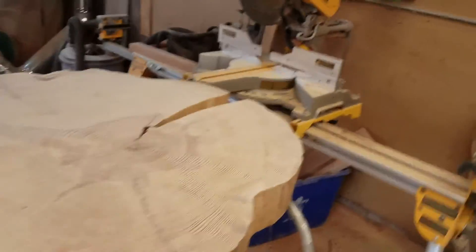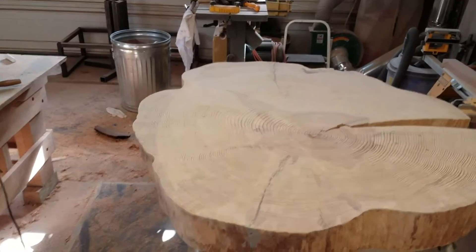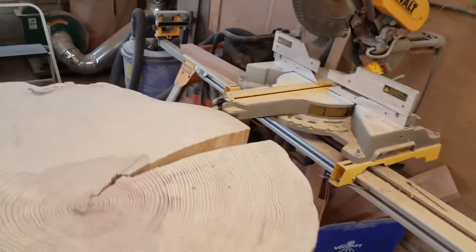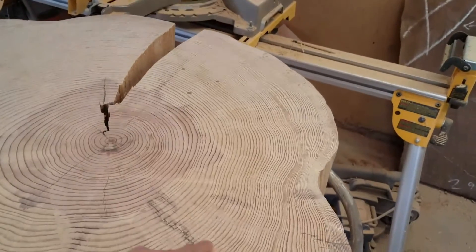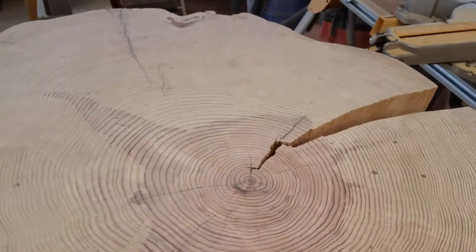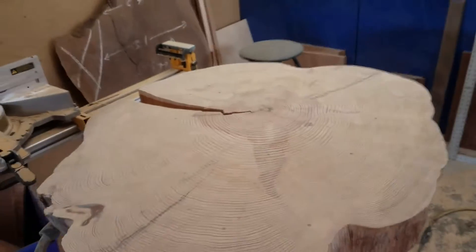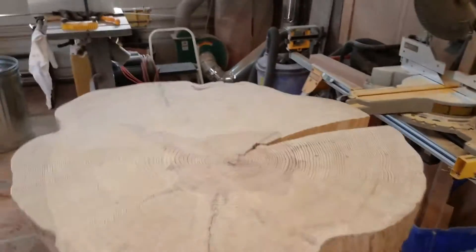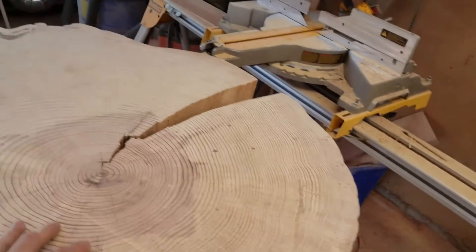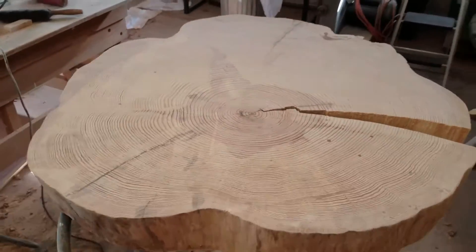Over here we have a major dust producer — whenever you're using the router sled or the belt sander to knock down ridges left from the router sled, especially on end grain, you end up doing a ton of sanding. This is a Douglas fir cookie slab. We filled a lot of the small checks with epoxy and are going to leave the one large crack and just stabilize it from the bottom. This is pretty much the final thickness. It actually dried very flat, moisture content looked good — it had been air-dried but stored inside long enough to come down nicely in humidity.